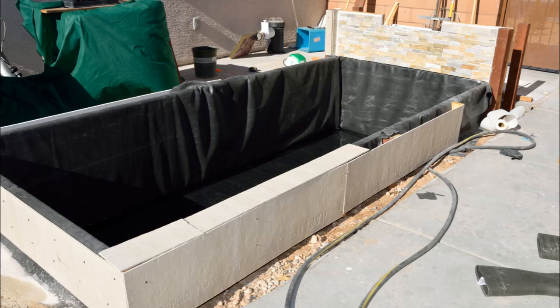I found another picture showing the hollow side wall construction. Due to the post structure I could not put the stone directly on the side as I did on the ends. This actually worked out well since it allowed me to put sealed travertine tiles on top, which gave the top a very finished modern look. Because the distance between the posts was six feet apart, I had to support the wall with two extra studs in between, as seen on the top right.